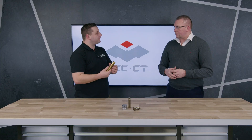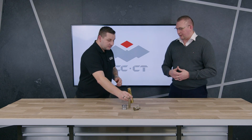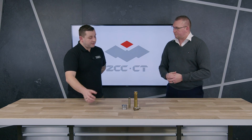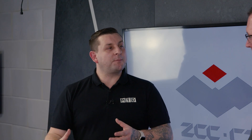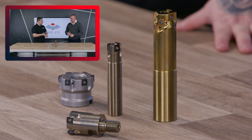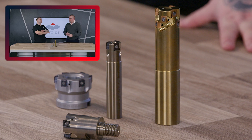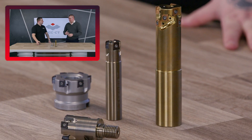You can take 22mm depth of cut at 20% engagement — that's a lot of material removal very quickly. You can use 3D strategies over an end mill, and it's more cost effective to use inserts than a solid end mill. Customers are forever asking for material removal as quickly as possible, and while this is not a new tool design, we're using this tooling in a different environment to give customers what they need. You don't see a lot of people using tangential cutters, and for me the cost saving and the amount of force you can put through compared to other tools means they can be used on a wide range of machines.